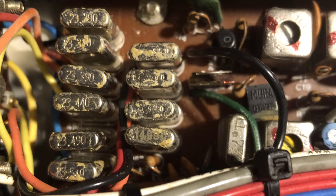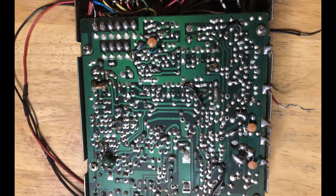With the project selected, I went to work figuring out how the oscillator circuits worked. The Cobra 21 uses three crystals at a time to mix to the desired frequency. It switches one of the crystals out for another one to adjust for the receive offset. This means I can use the VFO in the radio with minimum wiring and minimum extra components.